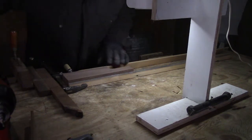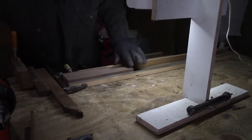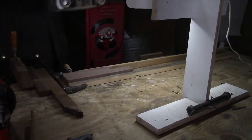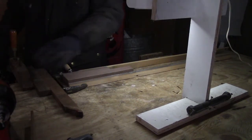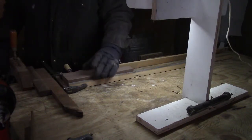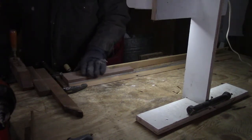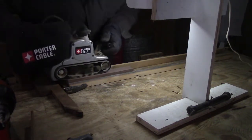And you want to make sure that the entire surface is covered. And I got a little bit to do here on this end. All right, now I'm going to make sure that I've got these all clamped. I've got two spacers here between this pack of material that I'm going to use for my door, drawer, lid, and then I've got two spacers, and then I've got this clamp holding everything together.